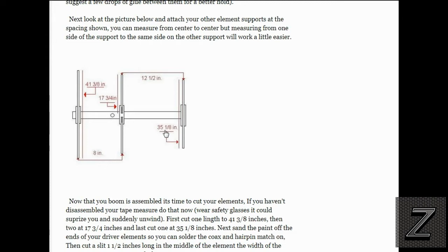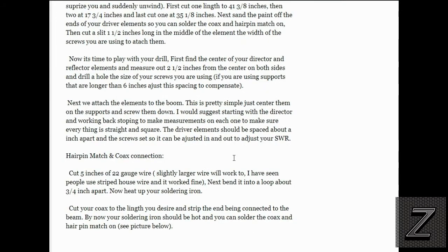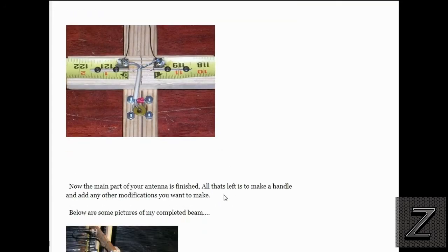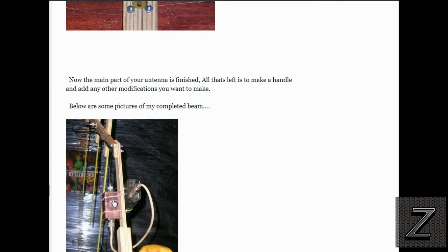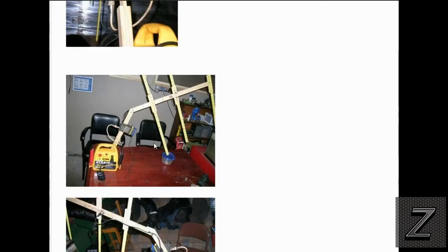All you need is a tape measure and some wood lath or PVC pipe and hose clamps. If you had to purchase everything, including a cheap tape measure from the dollar store, you could probably get a tape measure for around a dollar. The PVC, hose clamps, and other materials would run about $10 to $15 depending where you go. The rest of the details are on the website — you'll find a link in the description below. It shows you everything, including a picture of how the hairpin goes on and a finished picture of the antenna. I also made a little attenuator, which you can find linked on that page, for when you're using this for fox hunting to zero in on the signal better — that's another super easy build.